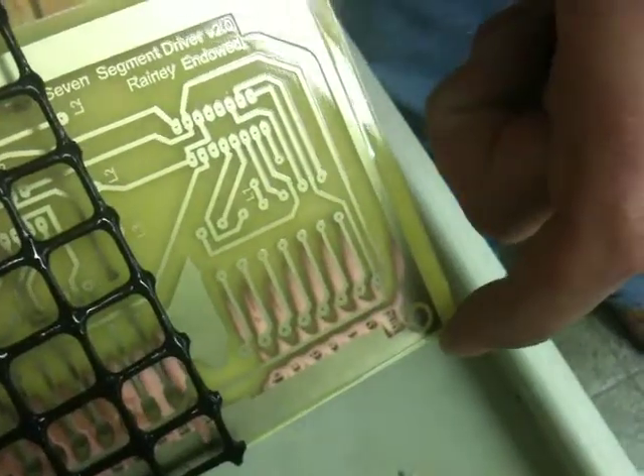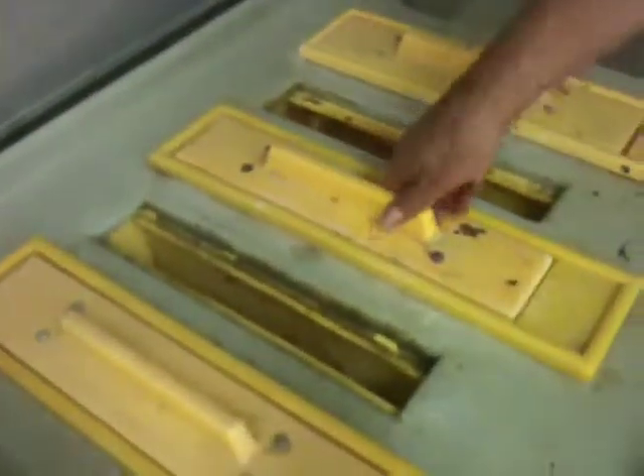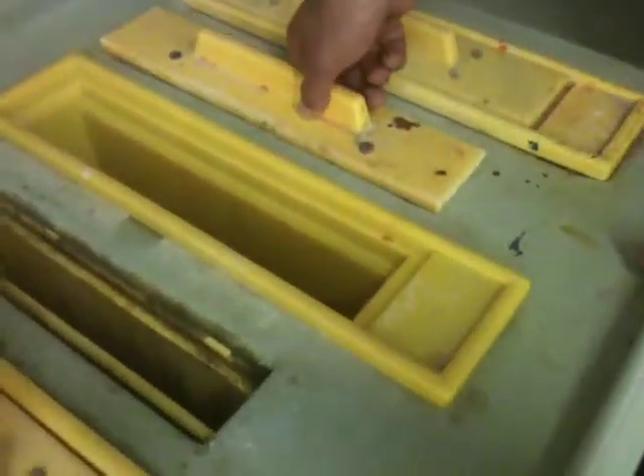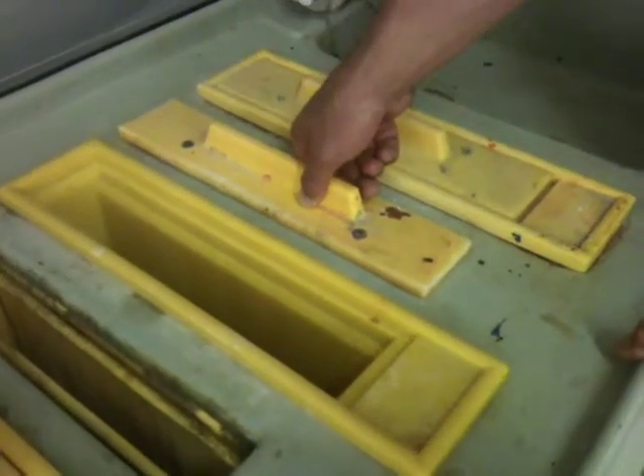In fact, that's what's happening just now in your picture. And you can see in that picture that the copper is almost all gone — you can see some traces of it still — so we'll pop it back in for just a couple more moments to get rid of all that copper. So now, under the dark areas is still copper, but that's been saved for us by the photoresist on top.